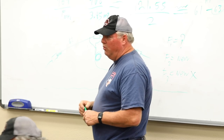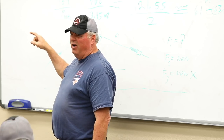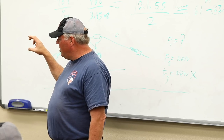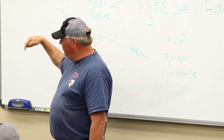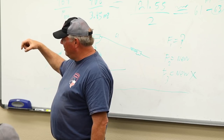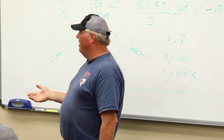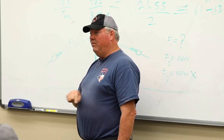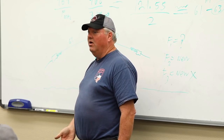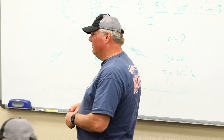And then there's the super cool ones that are made on toroidal cores, you know, the powdered iron cores. They're different, like the different numbers. There's 43s and 60 something, and I haven't memorized it. But the red one is pretty common, and you wind a current balun, two windings on this side and two windings on this side. And then they all look the same, but then we just connect them. We take this winding, connect it, and then the other two connect it, do the same at the bottom, and I'll draw it and show it for you. If you wind that right, you've just made yourself the super duper current balun that will work from 80 meters all the way up to 30 megacycles. That thing is awesome. That works good, the homemade loop-de-loop balun.